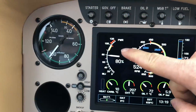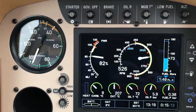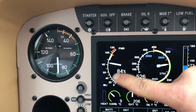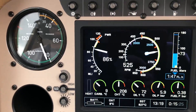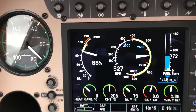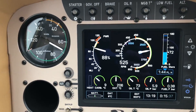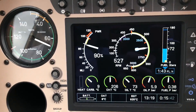We have two different modes. Right now we're in power mode. In power mode, you can see we're at 84%. If we were to go up to 100% right now, what it's basically telling us is there's still reserve engine power left over, so your throttle is not going to be fully open at full throttle. If you try and exceed 100% at this point, it's like when you're in a turbine and you're going to over-torque your transmission — exactly the same in this helicopter.